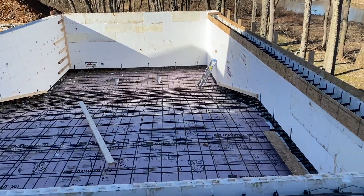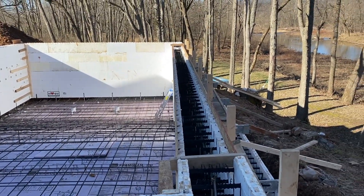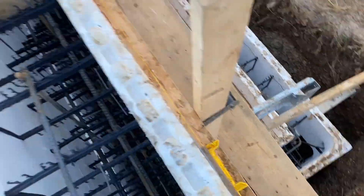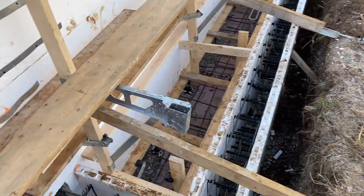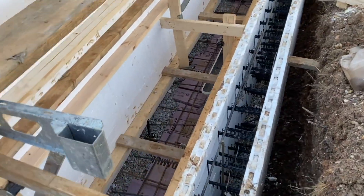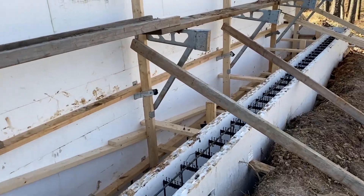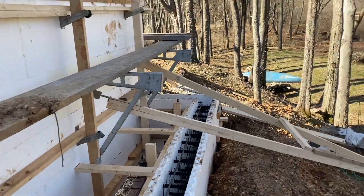I'm going to do a quick walkthrough from the outside, just a real quick tour to explain a few things. As you can see, we've filled in that gap with concrete like I said. Then we've got the 12-inch wall going all the way down to the catch basin depth — it's a three-dimensional thing but it's all one piece and that monopours as well. And we've got the three linear main drains running in series through there. Each one has three two-inch ports dropping into a three-inch line so we can get plenty of flow pulling out of this catch basin and running back into the pool.